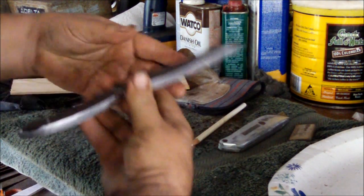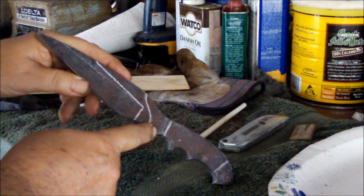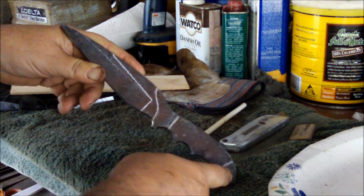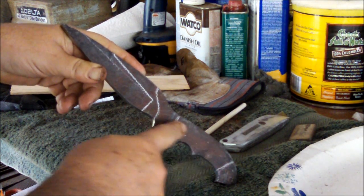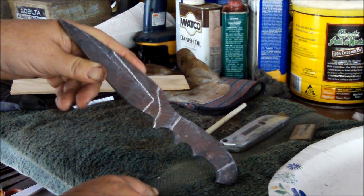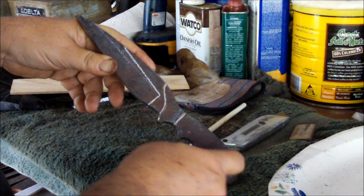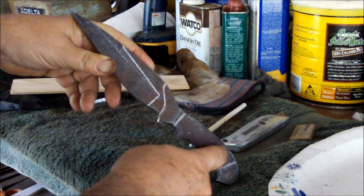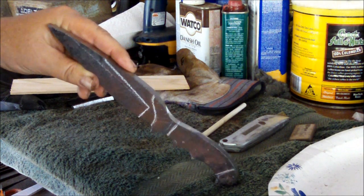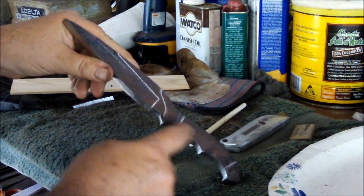And this is approximately the layout of the knife. I'm going to grind the blade here. This will be a steel guard, steel bolster. Steel, steel, steel. And I'm going to use some type of solid handle. I'm not exactly sure yet. I think it's going to be white Corian with small stainless pins. Stainless pin, stainless pin. It'll pretty much blend in with the steel, and it'll accent the Corian. I'm not going to use a mosaic pin, and I'm going to use red spacers. Red spacer material underneath the Corian.